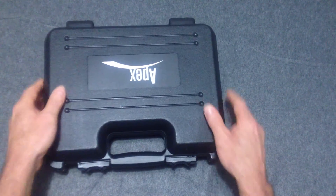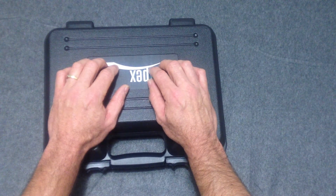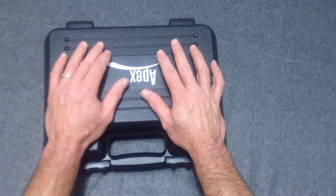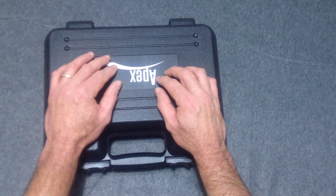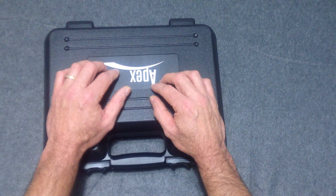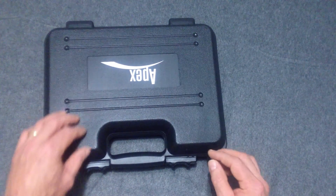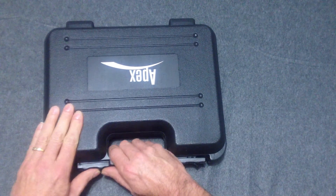I was getting some sort of buzzing noise or interference with my microphones — I don't really know what it was. I tried turning off the light, thought maybe it was the light buzzing, but that wasn't it. So I unplugged the power source from my Zoom recorder and I'm running it on battery power now, so hopefully that buzzing noise will go away.